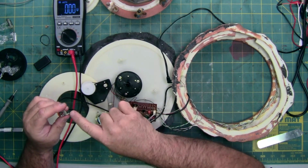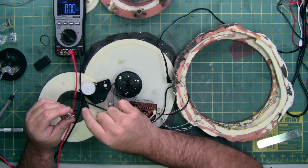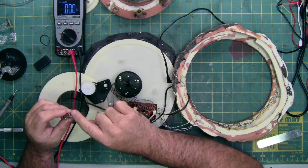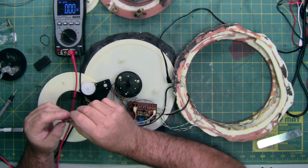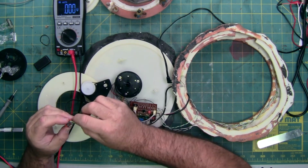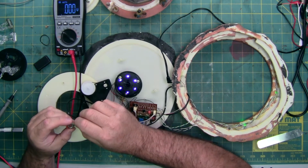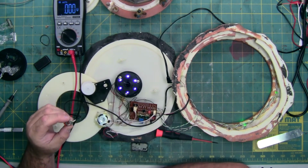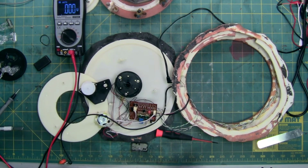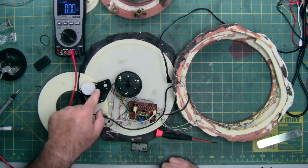You saw the voltage was changing. When I put my meter in there and I put tension on it so it would stay in place, a little bitty click happened. That click was probably an arc, and then everything started working. And then if I turn the switch back on, I have to keep it. Yeah, so it's got a bad switch. That's the first problem, of course. The second problem is I got a broken drive belt. And we saw this one spinning.